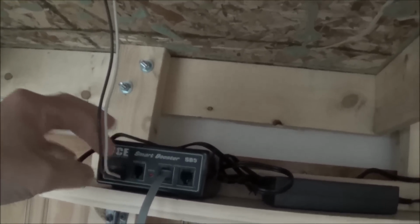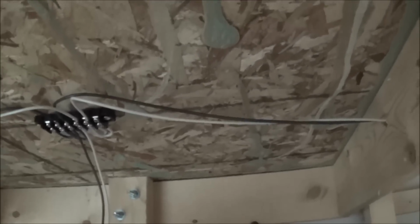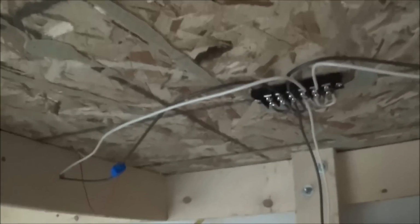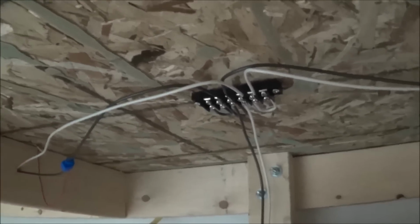Now whenever you wire this up out of here, of course, same as with the power cab, it doesn't matter which track wire you use and which side of this. What matters is whenever you're dropping your feeders, that you keep the same rail. That goes back to wiring your track, which is not really the purpose of this video. But when it comes to wiring your track, you have to keep everything consistent, so you use different color wire to help you keep track of that. And you want to connect the same rails to the same bus line, and so on and so on. You have to do that or you will have a short. But anyways, back to wiring.